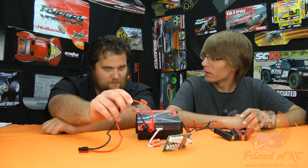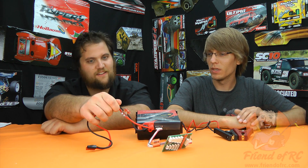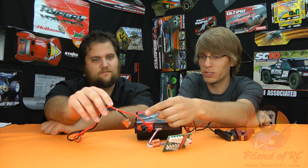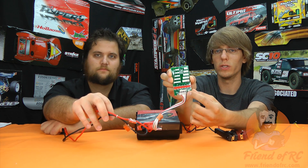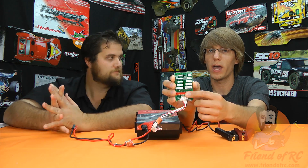Here's something noticeable on the unit — some fuses. This is Rev Electrics making sure that when you're doing 40 amps, you're well protected. The 40-amp fuse is soldered right under the main leads. And interestingly, even on the balance boards, there's a little red strip that looks like red tape — those are actually resettable fuses. If you happen to mess up your balance connectors and plug in the wrong size pack, this red tape turns black to let you know the fuse is blown, and it saves you from destroying your pack. Rev Electrics is really taking the extra step to make sure there's no way you can start a fire.